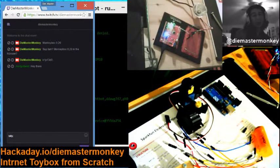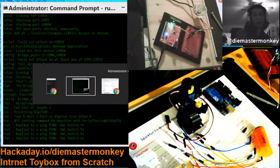And then we say P and which pin. In this case, it's going to be pin 8, right? Because that's the one I plugged into. And I say D and 1 to turn it on. And all low-level commands are followed by a semicolon like that. So that should turn it on, except for this number thing. So where do we get this number thing? I'm going to say it's B1 right now, but where does that come from?